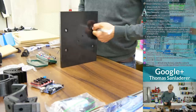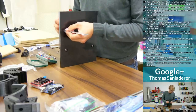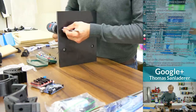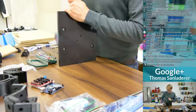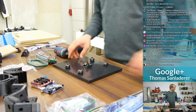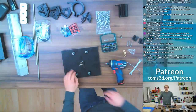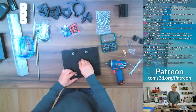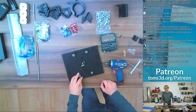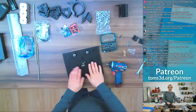Cooling aluminum on this thing is going to be fun, big air quotes there. Cutting it with coolant is your best option, and this entire thing is MDF. This entire thing is wood, so you don't really want excessive amounts of coolant slushing around in this thing. So that's gonna be interesting, how well we get it to cut aluminum.